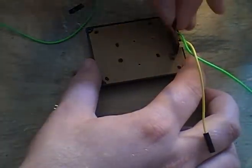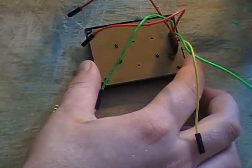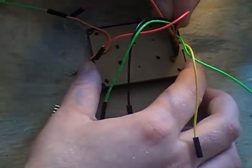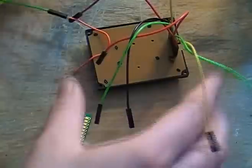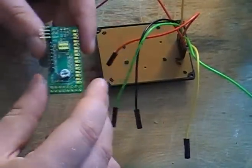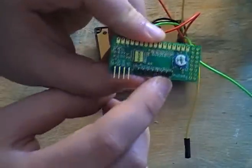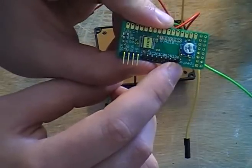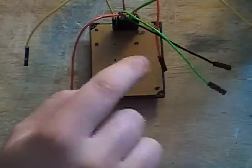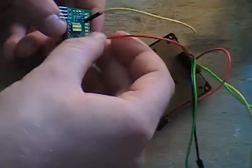Although his wiring diagram, I was never able to make it work correctly. So we hook all these up, and then we get our I2C module. Basically, this one is R0 — if you're looking at it like this, the one furthest on the right is R0, and the one furthest on the right of the keypad is also R0. So we just hook that up.